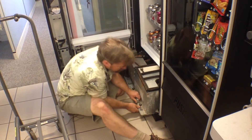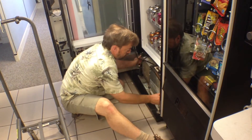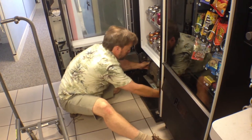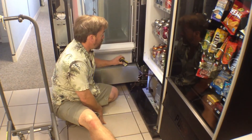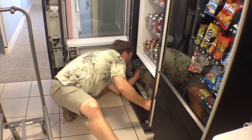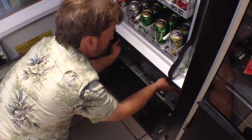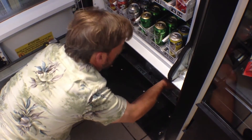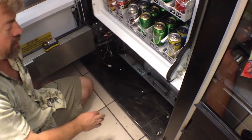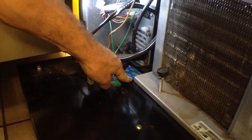We're going to use our two handles to lift our compressor using our legs and bring it down into position. Once it's in position, we should feel it lift up. I'm going to use my light to look in the back and make sure I have lined it up with our guides. Being careful not to damage the fins on the compressor, I push this back into place. As you can see, the new compressor is lined up with our tape so it's in the right place.